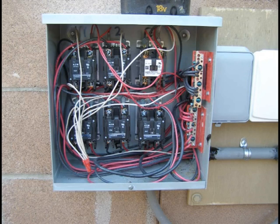And eleven — I saved the best for last — not one ground wire in the entire unit. This is a live, easily accessible 240 volt box that not only lacks any safeguards or labeling, but isn't even grounded.